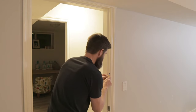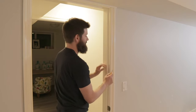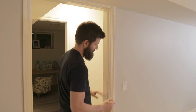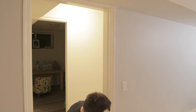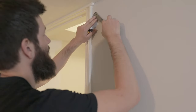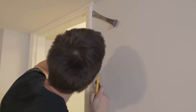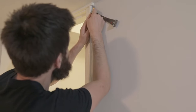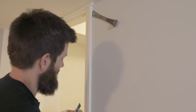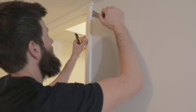Cut all the way along on the inside, taking your time to be careful that you're not swerving your knife into the jamb — you're just creating more work for yourself by doing that. Now that you've got both sides of the casing cut, take the little flat bar and slide it in there. As it starts to separate, notice any spots that still have a little bit of dap and cut those before you get too crazy with the pry bar, because if there's any bits attached it will pull the paper away.